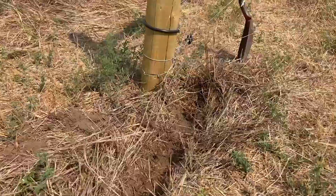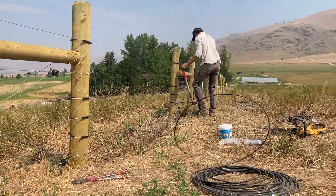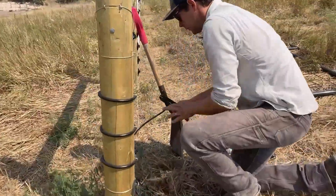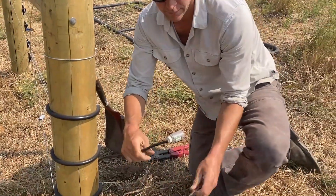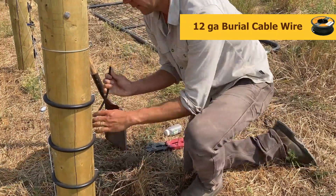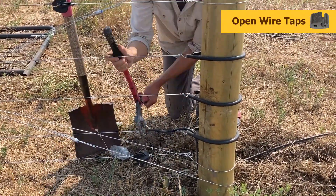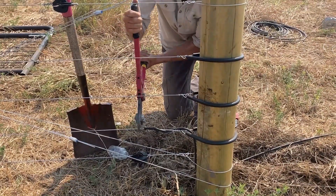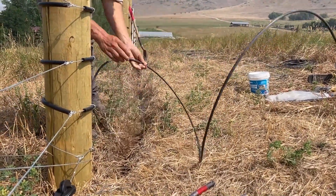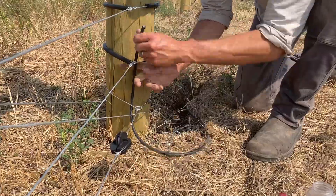If a gate will see regular vehicle use, you may want to bury the wires in conduit or other rigid pipe. Keeping close track of which wire is which — ground and hot — connect them to the appropriate wires on either side of the gate: hot to hot, ground to ground. We will use self-insulating, 12-gauge direct burial cable for this. It's affordable and available from most fencing suppliers. Use taps to secure the wires and cut off any loose ends. When burying a ground wire, always use insulated cable to prevent rust and shorts in the future. At this stage, it's also useful to mark the hot wire at both ends to avoid confusion once the wires are buried.